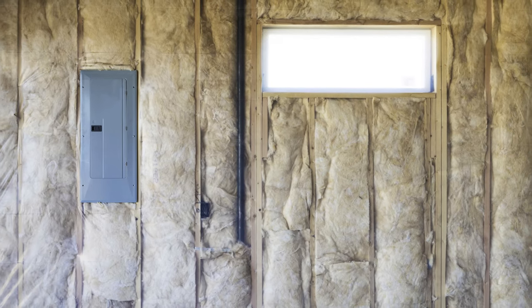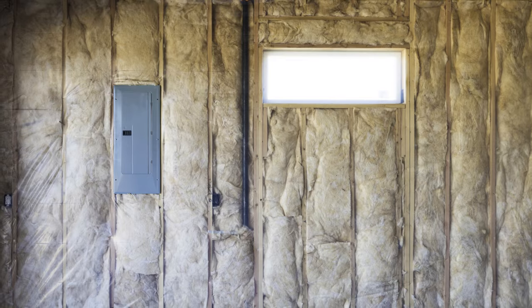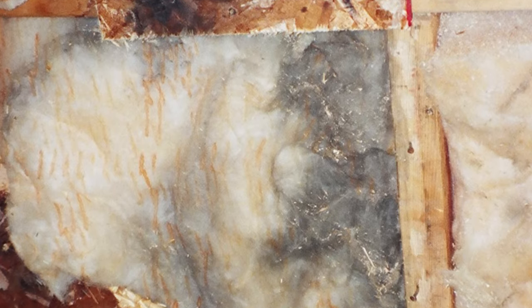The warning, on the other hand, is intended to stop you from building exterior basement walls in the same old traditional way that so many are done today, even by professionals. Stud frame walls with fiber-based batts between framing members is the way basements have been finished for many decades, but it's far from ideal in any basement, as proven by all those musty, moldy basements in the world.